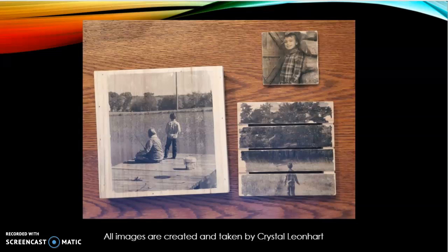Just a little troubleshooting: if you get to the end of taking the layers of paper off and the picture is not exactly what you want, you will have to sand the picture off and start from the beginning and repeat. There is no way to speed up the drying process without damaging the picture — using a hair dryer or anything like that will damage the picture or wood. Also, you cannot use a photo from a photo print; you have to use a picture printed on regular paper.